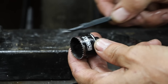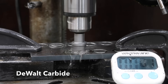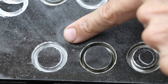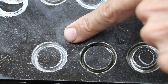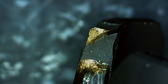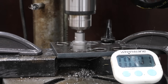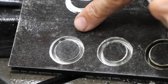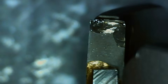The DeWalt Impact Ready won't be tested since the arbor and drill are all one unit and it's not being tested with the others. The DeWalt Carbide started off very strong but gradually lost momentum throughout the test, and unfortunately all four of the carbide teeth broke. Cutting through mild and medium steel, the DeWalt definitely seems like the best hole saw, but all four teeth experienced significant damage with the armor plating. The DrillHog also started off very strong but gradually lost momentum and didn't quite make it through — though it definitely did better than the DeWalt. All four teeth on the DrillHog experienced some damage.